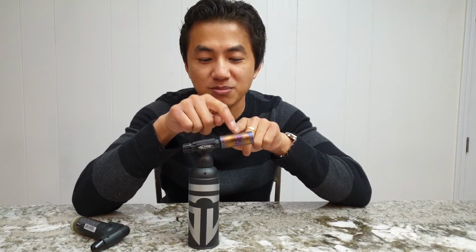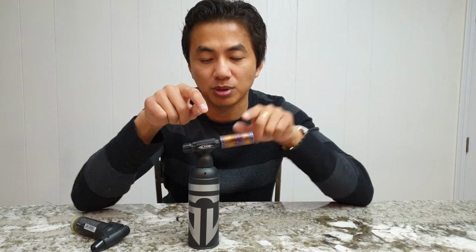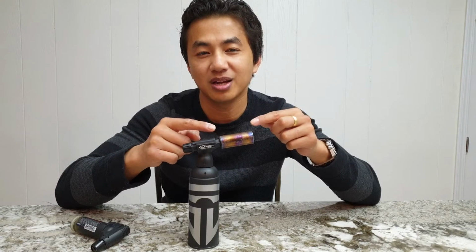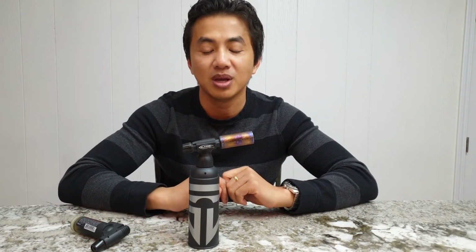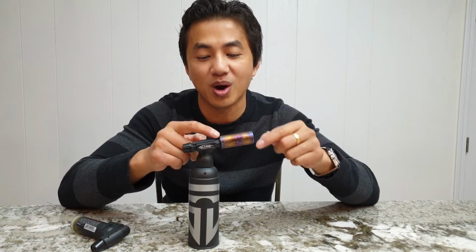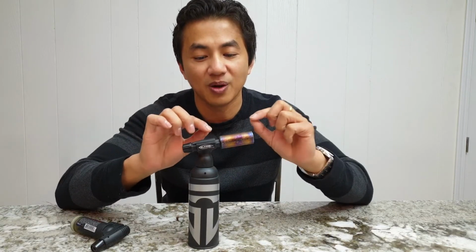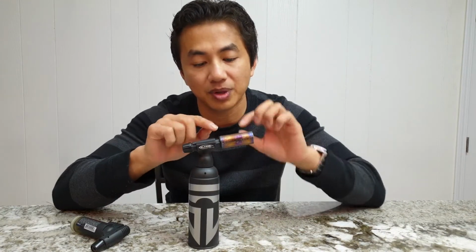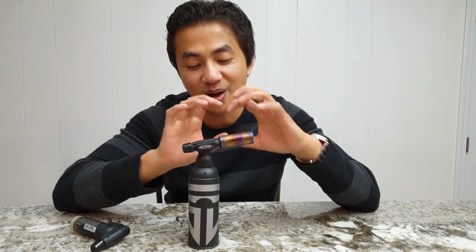So the center section, from gold, would turn itself into purple when I do just the rim out here of the bezel, with its first initial color in gold. But I don't want the outer ring in gold. I want it to be blue, which is the last color before you lose all the colors. So I would want to hit the fire just at the edges and not on top of the bezel, on the body.